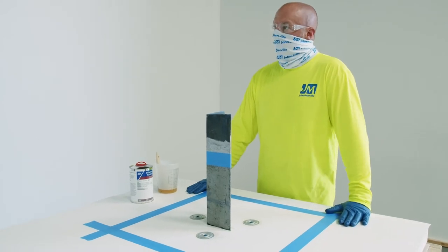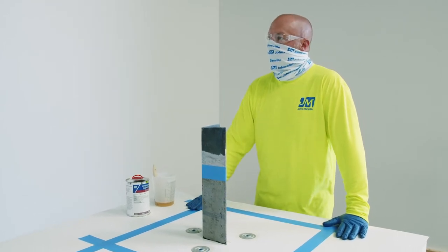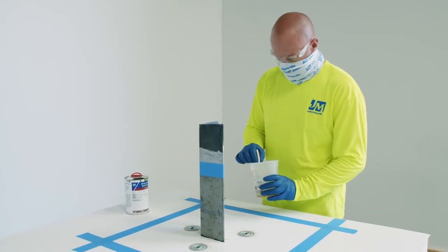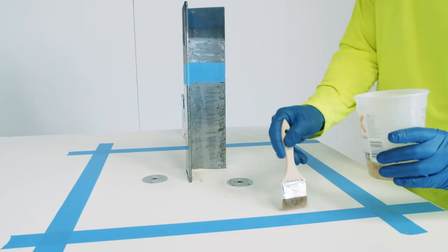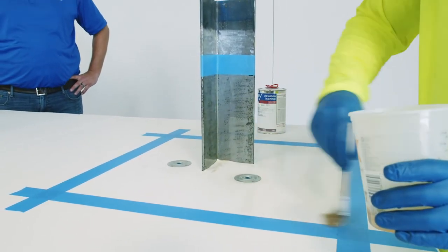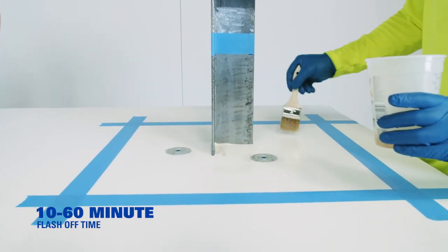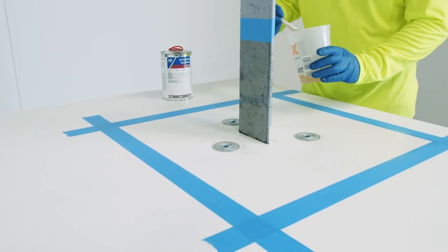Any special preparation we need to do to the surface before we put the primer on? We've already gone over the sanding and the cleaning from yesterday. This morning I went through and made sure there wasn't any dirt and debris that gathered overnight, and I'd already cleaned those to make sure they had plenty of time to flash off so we'd be ready for the primer. As a single-component product, it's more of a flash-off time than a cure time — it's environmentally driven but it's going to be really quick. It's a very thin primer; we get that on, brush it around, make sure it's nice and even so that it all flashes off at the same time.